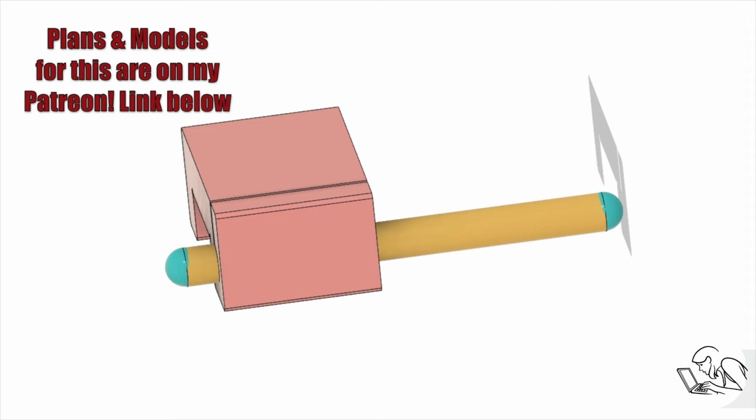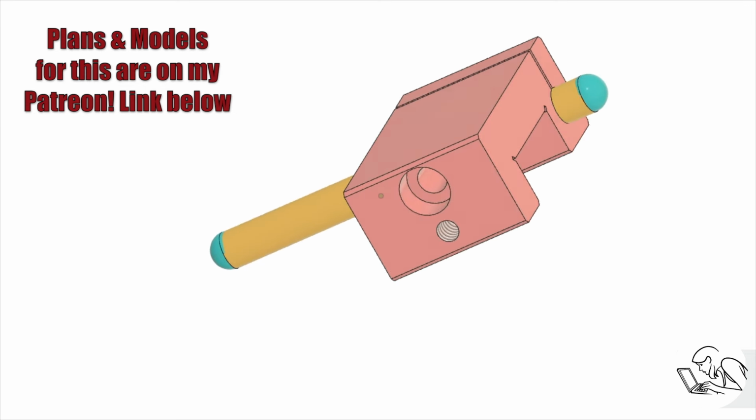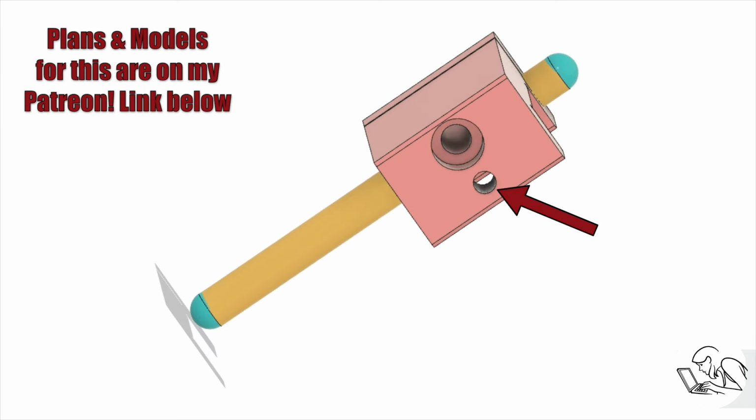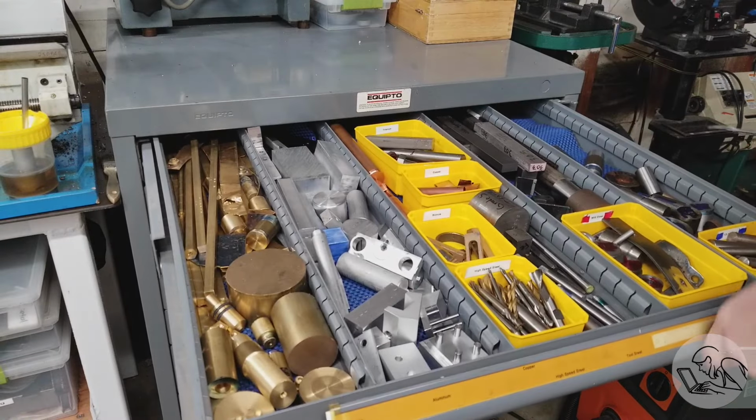Here's my little design for a vise stop. So the rod there moves laterally and it's got spherical ends on it, and then the whole thing clips to the vise with a set screw on the back, and then the larger counterbore screw there is to clamp the rod in place. To the junk pile now to see what I've got to make this out of.